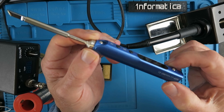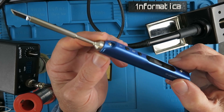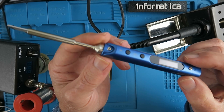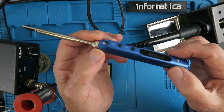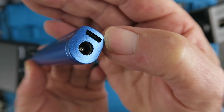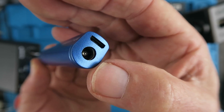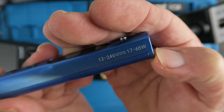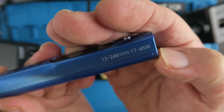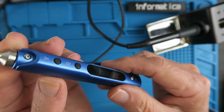On then now to the main subject of today's video — this little TS-100, otherwise known as a SQ001 soldering iron. What does it bring to the table? Clearly we can see that it's a nice portable size as well as the USB connector which we will come on to. The main power connector is this 2.1 standard size jack rated from 12 to 24 volts DC and can generate from 17 to 65 watts, which is quite an achievement for such a little guy.